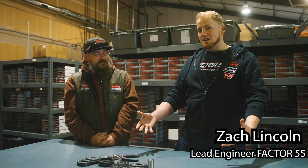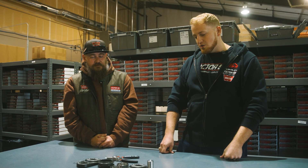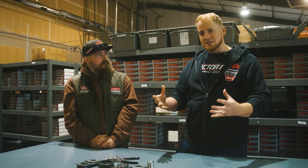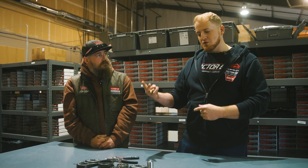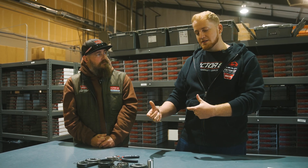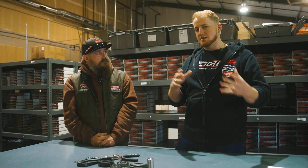This is a piece I'm super excited about. A lot of work and effort has gone into it, and I'm really happy to share it with everybody. It's a SnatchBlock, but it's the smallest, lightest, two-bearing SnatchBlock on the market. The two bearings carry the load, so it reduces the rolling resistance and gives you a much greater efficiency than something like a rope retention pulley that we also sell.